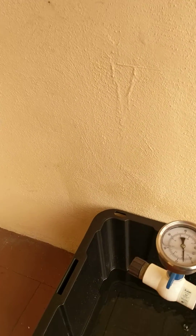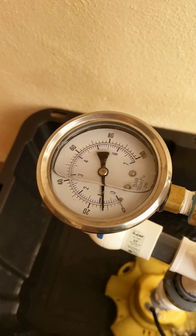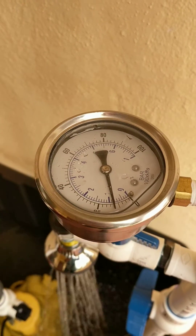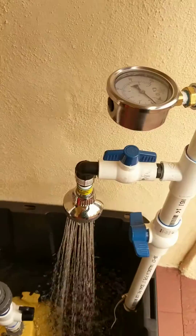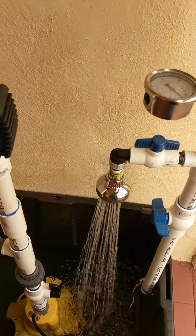Let's take a look at the pressure now. With really minimal pressure, you see we're just under 10 coming off of the pump. Jump over here — just about exactly the same. So we know wide open we're running 10 GPM. We know that we have a very low-pressure loop with just one GPM fixture, and that's the whole point.